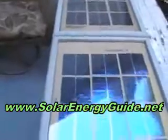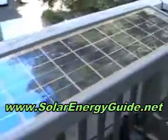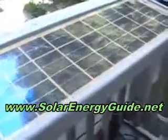Now, you can see from here that if you follow the right side up, it goes all the way up to the top, comes over, comes down the middle section, meets this side, and then goes back up to the top. These are all in line, or you would call it in series. This solar panel would make up 18 volts at 1.7 amps.